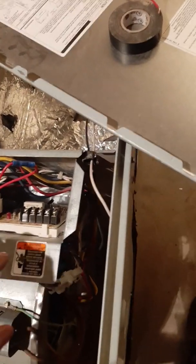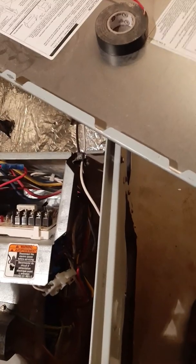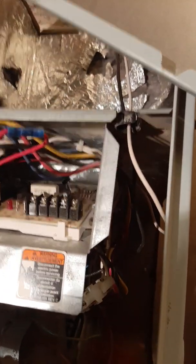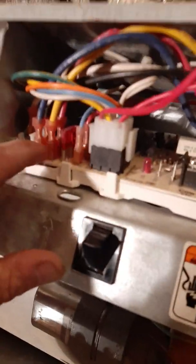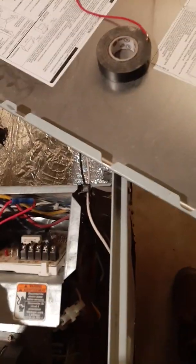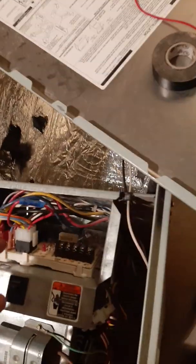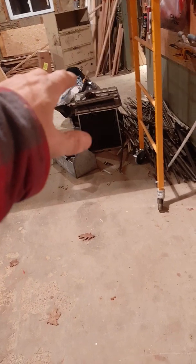The main point I wanted to make: once you get everything out of the old furnace, just keep what you need. The black wire is the one you want — these others are parked and not doing anything. There are four speeds: medium high, medium low, low is red, and high speed is black. Those are your neutrals, and the power is in behind there. Get rid of the rest — you don't need them.